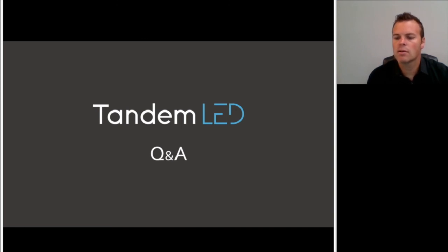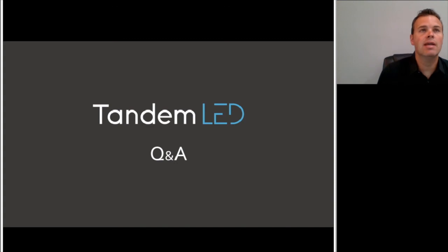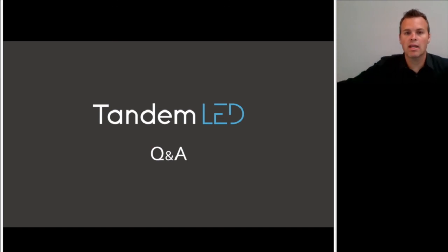So yes, again, there is aluminum channels. If you're looking to eliminate the LED dots in the countertop, but also go back to what we talked about earlier, remember that there's 88 LEDs per foot. The LEDs are so tight together that you don't get that individual dot effect. It looks more like a beam of light if you have a very highly reflective surface.